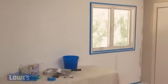Now if you have vaulted ceilings, use the highest point or an average height. And by the way, don't bother subtracting for doors and windows. It doesn't make any difference when it comes to the amount of wall covering needed.